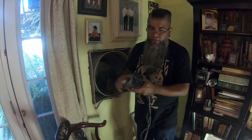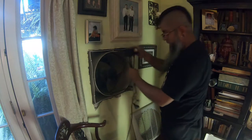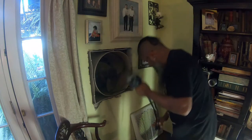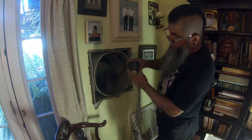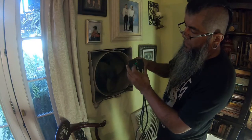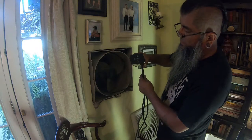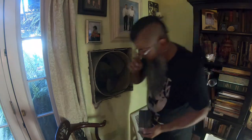Now we've got our controller and I'll show you how you can tell if it's faulty. With everything unplugged — no fan plugged into it — plug it into the wall. If you see the green light is just bouncing around and you can hear clicking, that clicking is telling you that this is faulty. It won't even let me turn it off, and if I turn on the pump, they both won't work together.